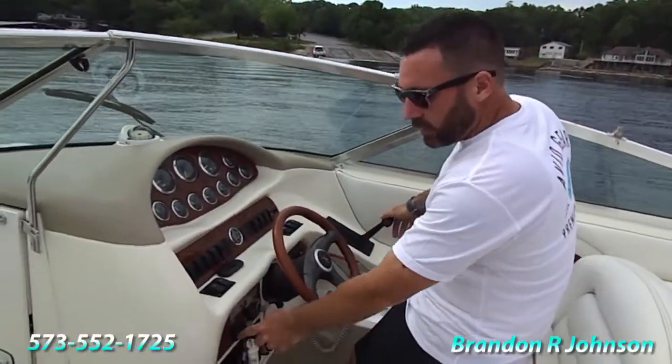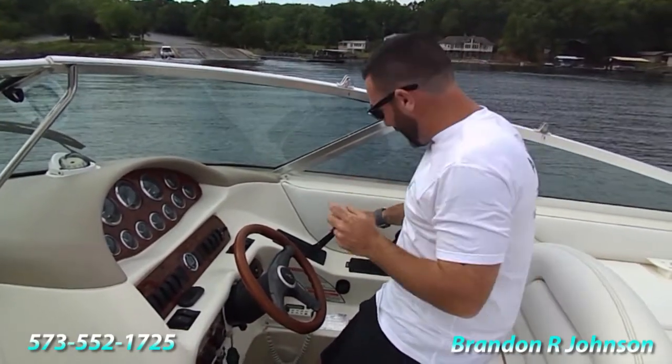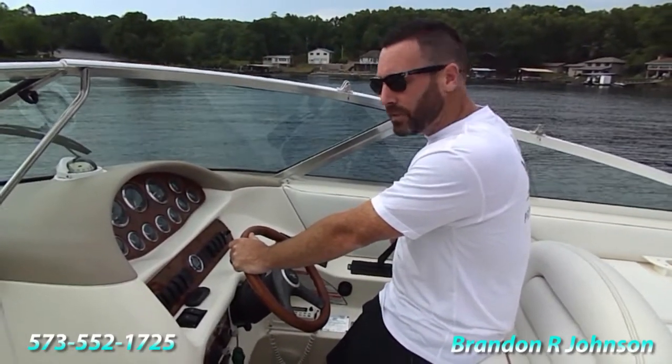Now, you got a bilge blower right here. You should use this. I can hear it on. I'm sure you can't, but I can hear it on. You can use this to ventilate the engine compartment. I strongly recommend, if you just got gas or you're at idle, to use that.